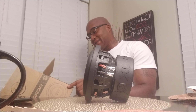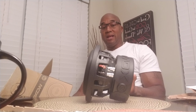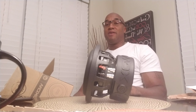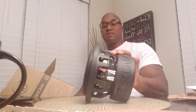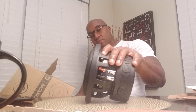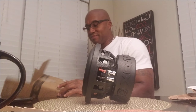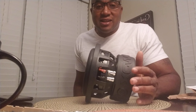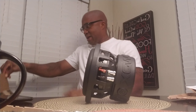In a ported enclosure the port is actually louder than the radiating cone effect. SPL is 80.2 dB. The Xmax is 10 millimeters — I'm not sure if that's one-way or both ways; if both ways the Xmax is five. Most DB Drive lists things one-way. With a 1.5-inch voice coil this is similar to a DB Drive G5, but because of the smaller voice coil I think they'll have a larger spider. The moving mass Mms is 77.157 grams, which is not heavy.